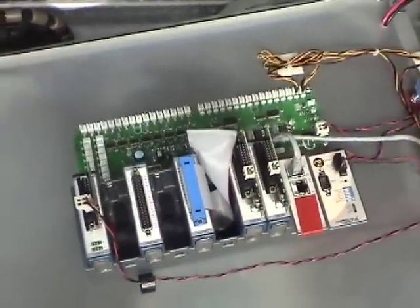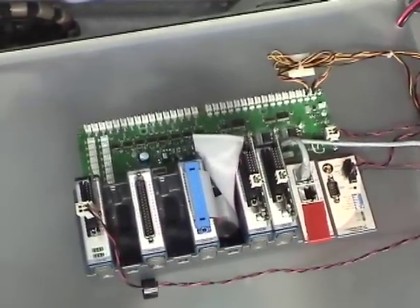Before, they had an 8-bit 40 megahertz processor, so they now have a lot more processing power. Also, because there's an FPGA, we're able to offload a lot of the motion control algorithms to the FPGA so the CPU doesn't have to handle those. We transfer data through DMA, so teams don't have to use interrupts that take up processor time.